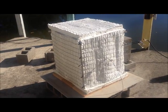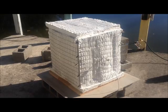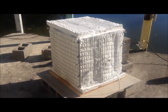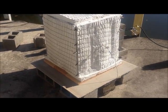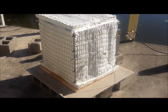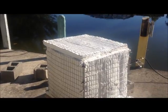I've got my first disc firing underway in my new portable flat-pack ceramic kiln. This is a two-foot by two-foot by two-foot cube, mounted on some fire bricks that are set on top of a piece of Durock on top of some concrete blocks. For safety's sake, I've got it out in an open area on my concrete dock overlooking the water.